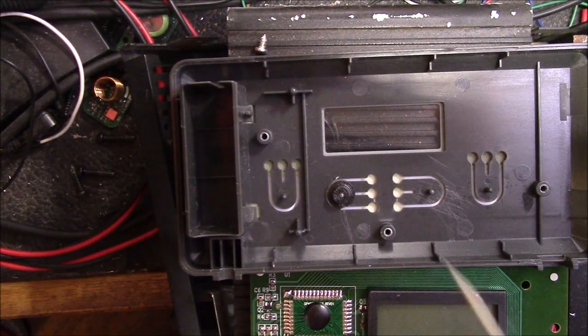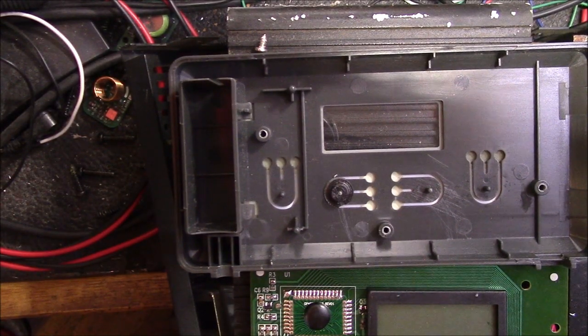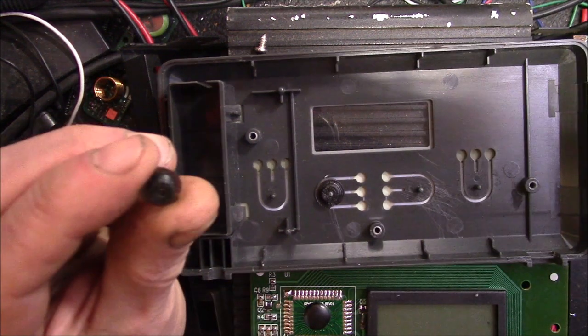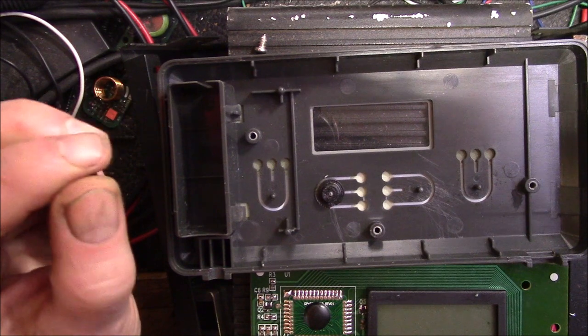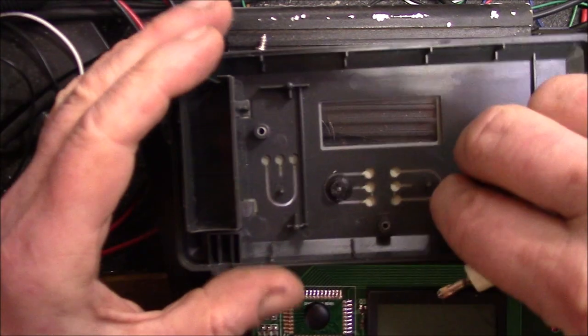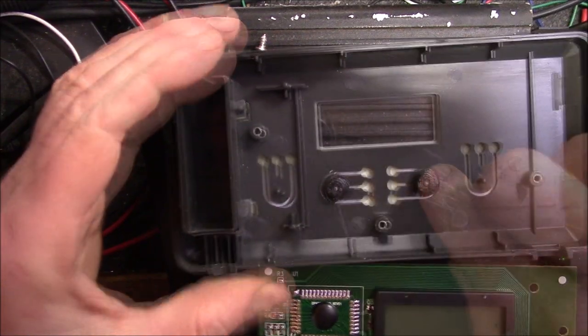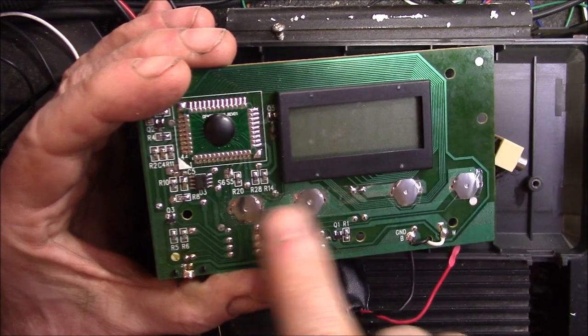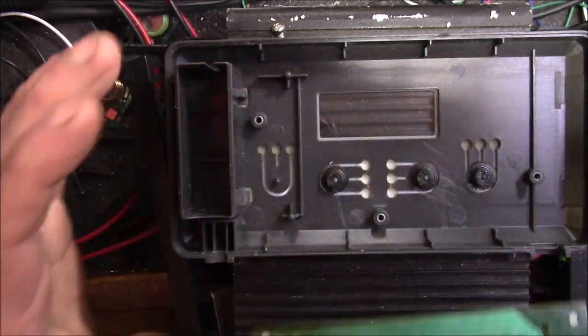I print it with a brim and just put the brim side down. I've made these about 7mm diameter and about 4mm tall with a hole in the middle, and then they just fit right over there — press fit.